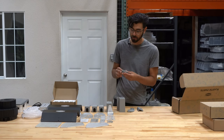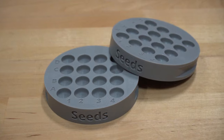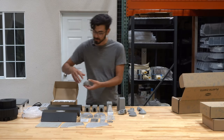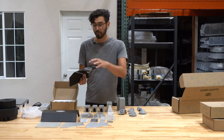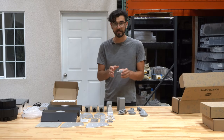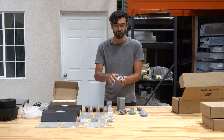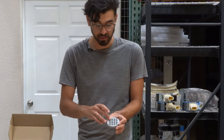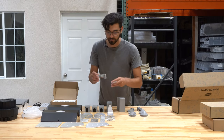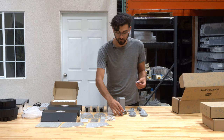Included with the Genesis kit are three different types of seed containers: seed troughs, seed trays, and seed bins. If you're planting a lot of the same seed, we recommend using the seed bins — just slide them into the tool bays and dump a bunch of seeds in. If you need to tightly control the number of seeds picked up and placed in each hole, you can use the seed trays, which have 16 holes each allowing you to plant up to 16 different crops. The seed troughs and seed trough holder mount to the gantry column, allowing the FarmBot to carry seeds along the x-axis for quicker planting sequences when far away from the tool bays.